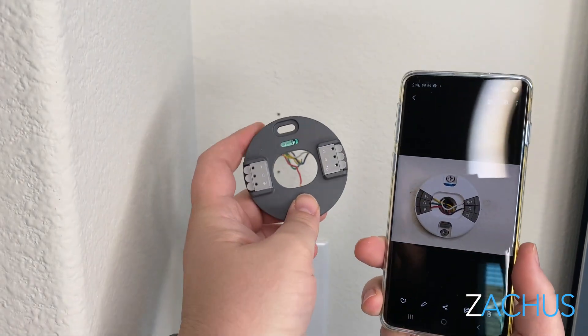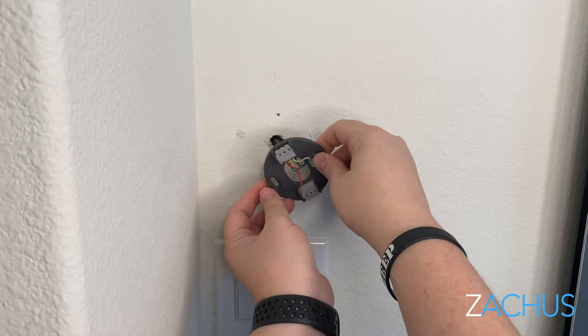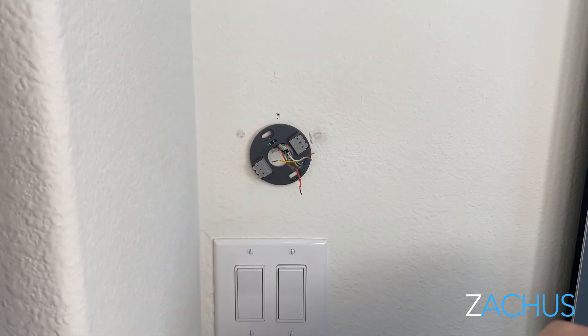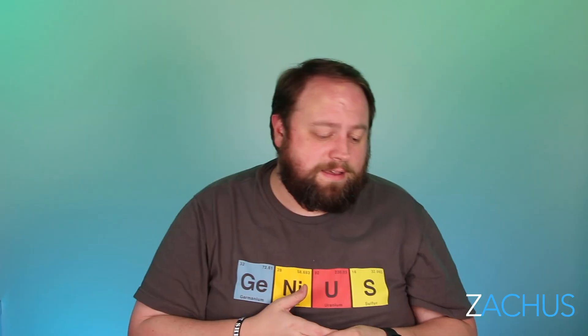Now you're ready to start installing your brand new Nest thermostat. Grab the base plate — it's the one with the wire holes on the end. Carefully put the wires through the center. You'll see there's a little leveler; all Nest thermostats have a little leveler on the back. Make sure that bubble is right in the middle or close to the middle. Then take your screw and press into the sheetrock a little bit on the bottom and top so you'll know where to put your screws. If you have a good screw gun, you can go ahead and screw it in, depending on whether it's a stud or just sheetrock.